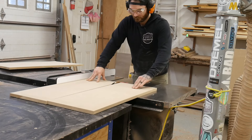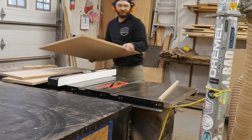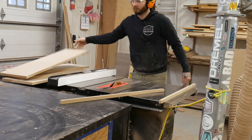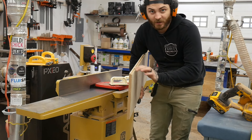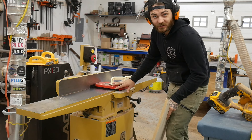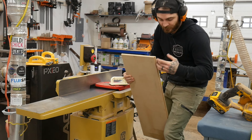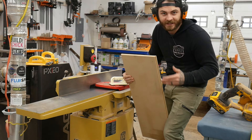Now to cut my strips, I got this half sheet from Home Depot for like 30 bucks. You can have the big box store cut these for you, but I can't promise they'll do a good job. So I added this little groove to sit on top of the T-tracks using my fancy joiner. You may not have this feature on your joiner or even own a joiner — if you don't, I would just use a rabbet bit. I'll add a link to a rabbet bit down in the description, and all you need is a handheld router of any kind.